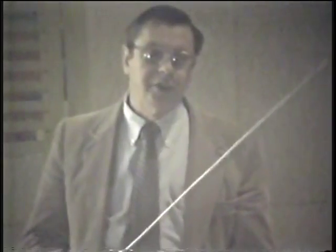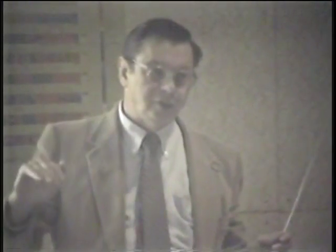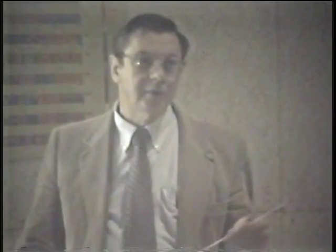If you record with the SuperBeta switch on, this shift may cause an ordinary Beta machine to overmodulate, or to give the impression of overmodulation, which is, and I don't have an example of it unfortunately, black streaking after a sharp edge. You'd really see that if there happens to be a very bright object in the picture material. It really streaks like crazy. Also, the contrast is washed out. Smeary. Yeah, the horizontal streaking is what we're getting the most complaints about.